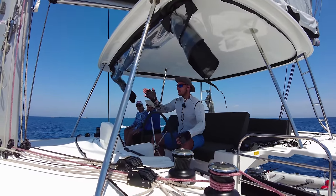You need a lot of power, but if we had like 35 knots I might not have enough power to turn the boat quickly, so it would be much smarter to reverse in and go directly to the spot. As we said, catamarans are not easy to go backwards, especially here with this flybridge. You don't see much, but it would be smarter in this situation.